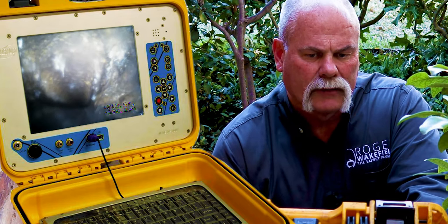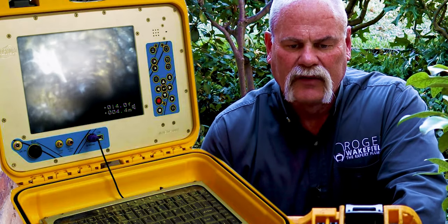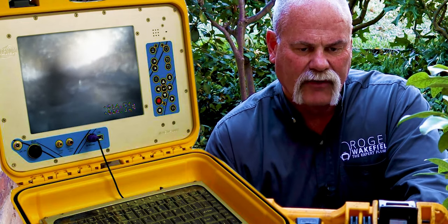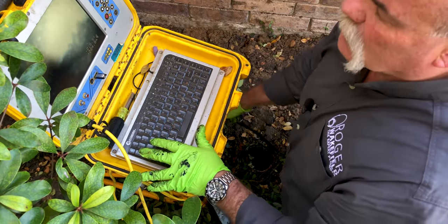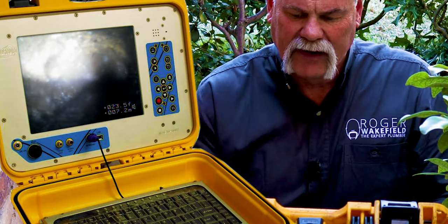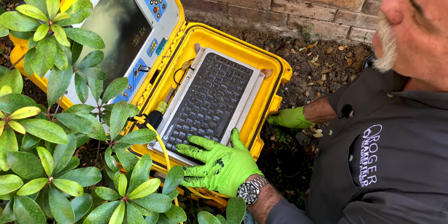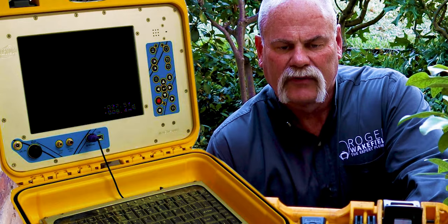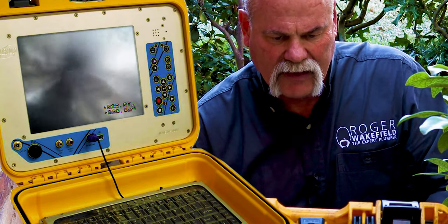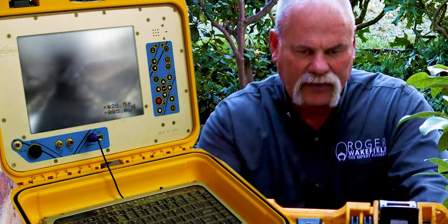There's roots there. It makes a little bit of a drop right there, so there's like a belly. You can tell by the way the camera angle turns — it's pointing towards the top of the pipe and then I go about a foot and it drops back down. That lets me know there is a belly or a break or something right there. I'm not going real slow here because I'm not really looking for any fittings. I'll turn my lights down just a little bit to see if that helps the view. It goes down into a drop right there before it comes back out. You've got a plastic bag or something in there, so there's all kinds of things that have been getting down in this sewer.